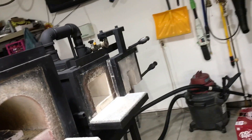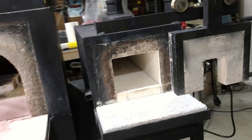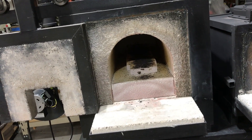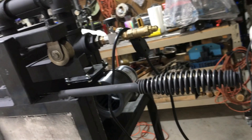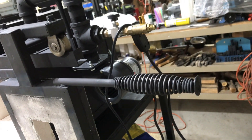I've also had the small forge up over 2,400 degrees as well. Obviously the small one heats up quicker — it takes about 15 minutes to get up to heat. The larger one takes about 20 to 25 minutes. I did not put an airflow valve on the small one; I just run the fan straight out and control the temperature with the propane.